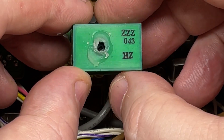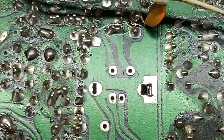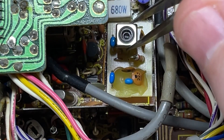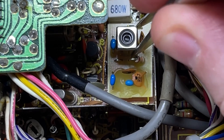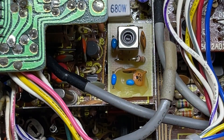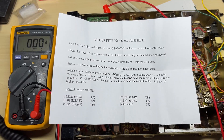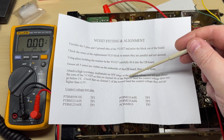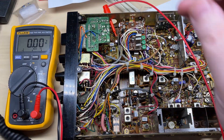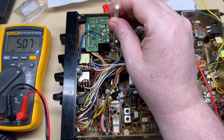As you can see, the VCO unit is in a metal container and it's heavily potted. So I've cleaned up the solder pads, and then we have our Spectrum VCO. Hopefully this should give us a little bit more range on the VCO as well, which we are going to need. The capacitor has been replaced back on the back of the board. For VCO alignment we need to put a voltmeter on TP1 — ours is a 121A4X — and adjust the VCO for the voltages specified on the installation sheet.